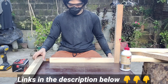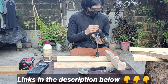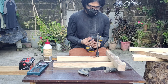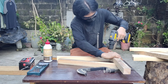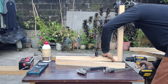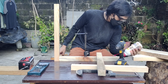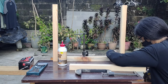Of course using Lotus's brushless and cordless drill. By the way, I'm going to put all the tools and stuff I used in this video down in the description below. Now I'm drilling pilot holes. Pilot holes are there so that you could drill in your screws much easier and also without risking breaking the wood. If you have experienced splitting or breaking wood while drilling, it's because you didn't have a pilot hole. So for normal black screws, you use a 3mm drill bit.